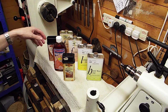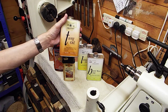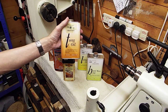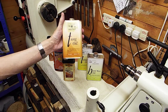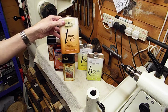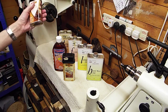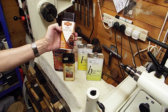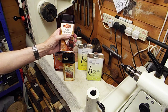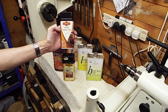Next up, let's look at tung oil. You've got to be careful — this says tung oil but it's not pure tung oil. It's mixed with other ingredients, dryers and such. Just because a can says tung oil on it doesn't mean it's going to be pure tung oil. This other can here at the front — this is Liberon pure tung oil. You know it's pure tung oil because they can't put 'pure tung oil' on the can unless it actually is.